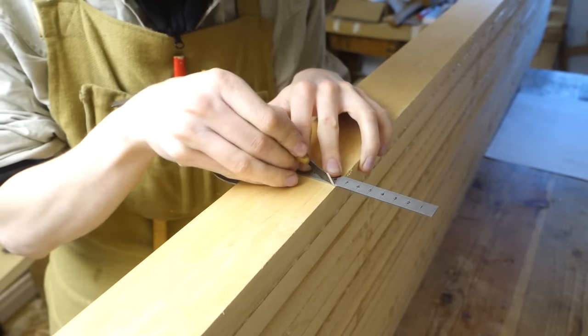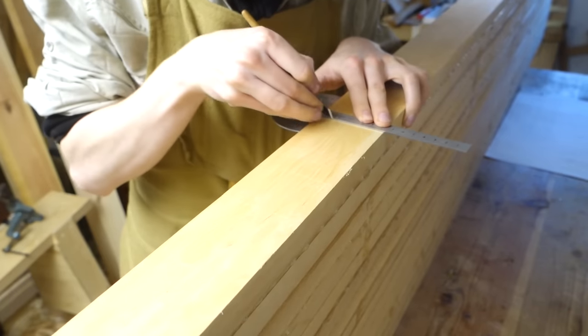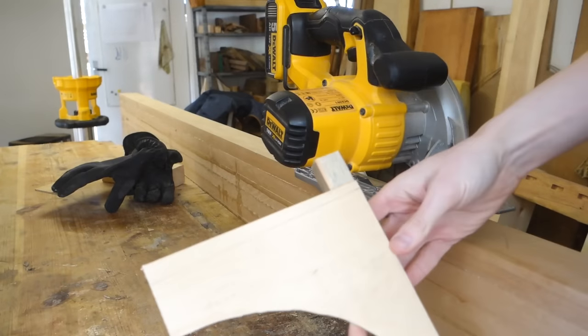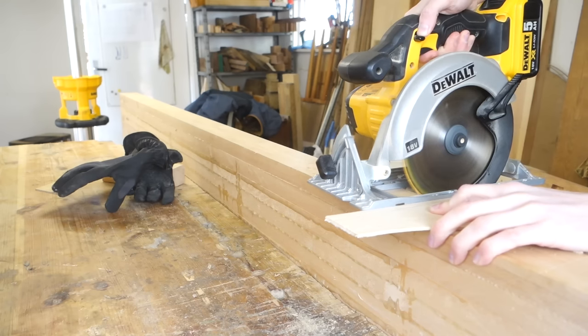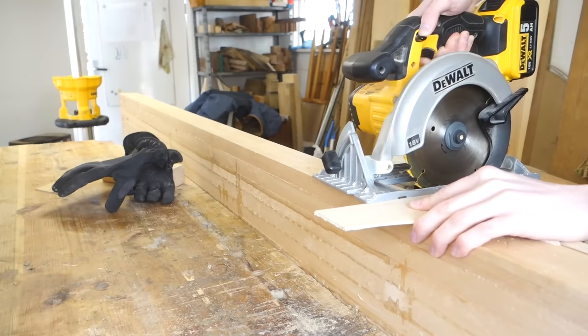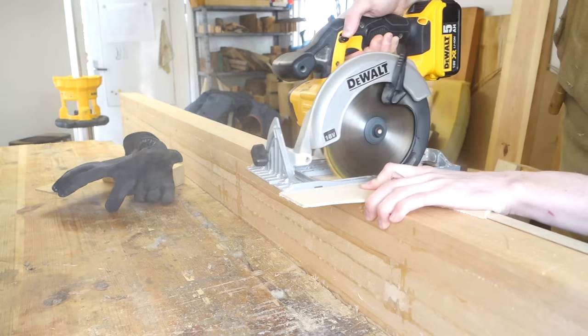This is done so the top of the bench dog contacts the workpiece first, which sounds like it would be a bad thing, but there is always a little bit of flex in the system, and I've found that with perfectly plumb dogs, the workpiece has a tendency to lift up off the bench. When you then go to hand plane it, the piece can slip out of the grip. Angling the dogs towards each other prevents this issue.